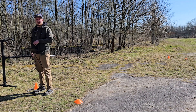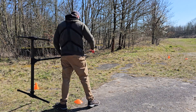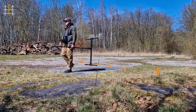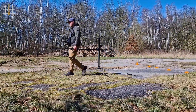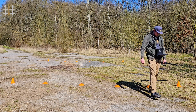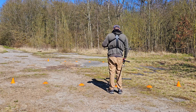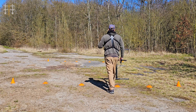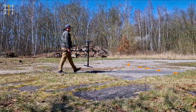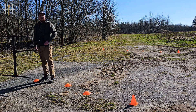For the second line there are two variants. Here is the first one: turn around and grab the pentasensor rod with your other hand so that the probe is still pointing in the same direction. Align the probe with the starting point and walk back at the same speed. Turn around again, grab the rod with your other hand and take a step to the left. Align the probe again at the starting point and walk the scanline evenly and parallel to the first two scanlines. Make sure you keep the probe straight and at the same distance above the ground.